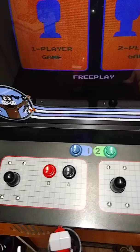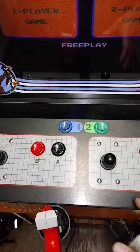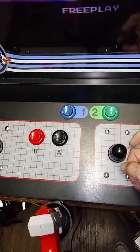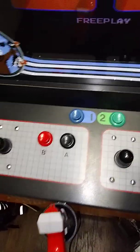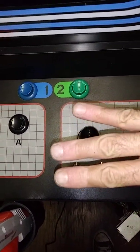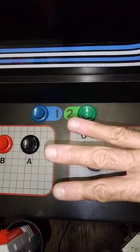One other thing you're going to have to do, if you're running an original Nintendo VS system setup, is that your alarm is going to sound without the original harness for your light gun. So you have to go underneath your control panel to the cherry switch that activates the up signal. Of course I don't have one for you to look at, but your micro cherry switch has 3 connectors on it. Your top one is a ground, your center one is a standard connection, so when you engage it you get the action that you want, and the bottom one is like a common.